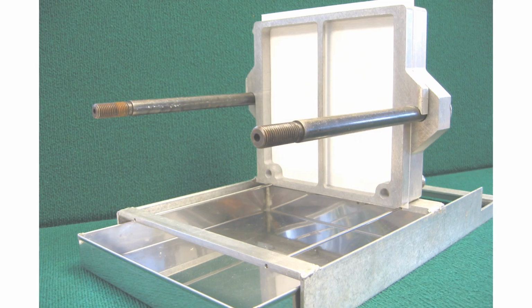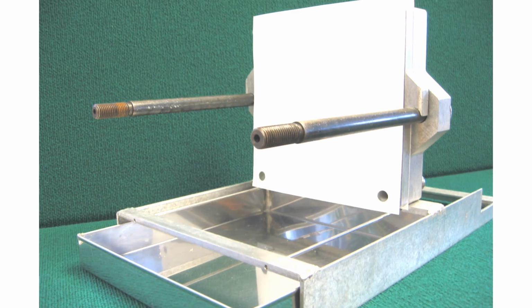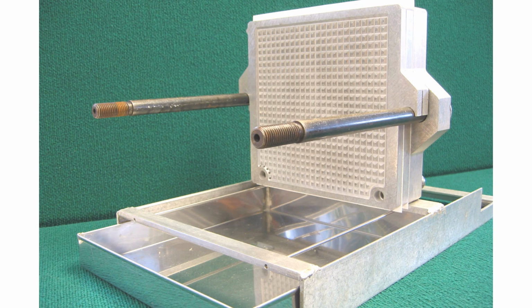Then you put on a cake plate. So you've got a backer plate, piece of filter paper, and then a cake plate. You need another piece of filter paper after that, and then you add a backer plate. This gets repeated over and over again, but this is basically the whole thing for a filter press. You've got backer plates and then a cake plate in between. The hot syrup, unfiltered syrup, floods into that cavity and gets coated with DE and then gets filtered out.